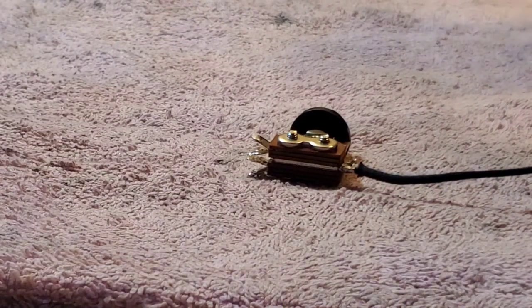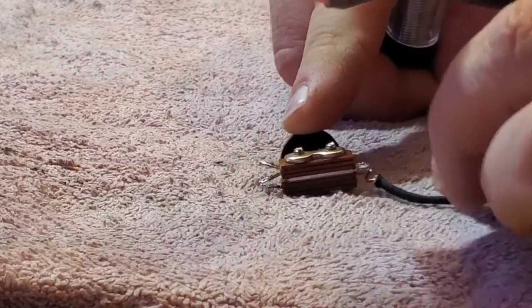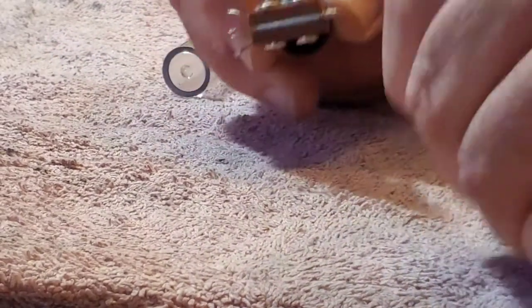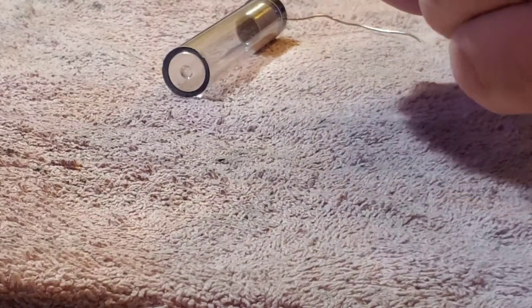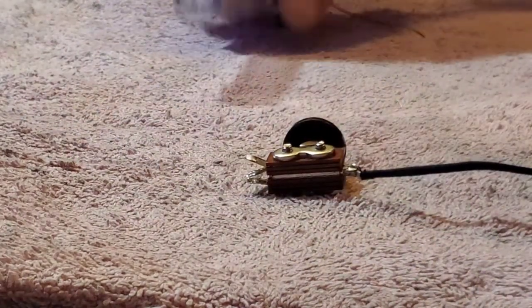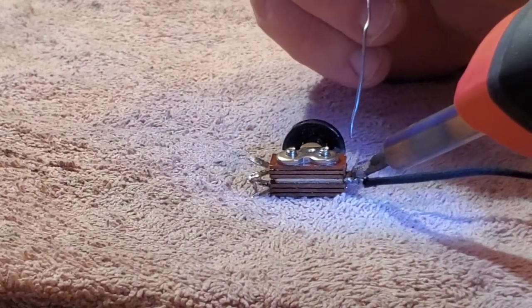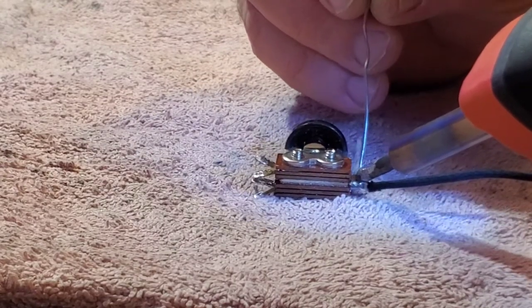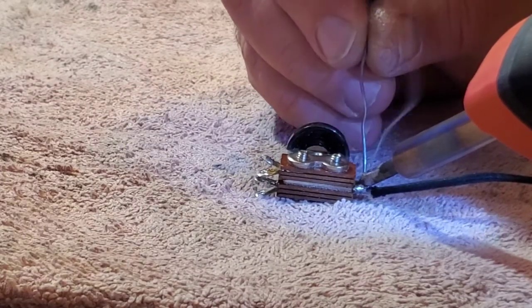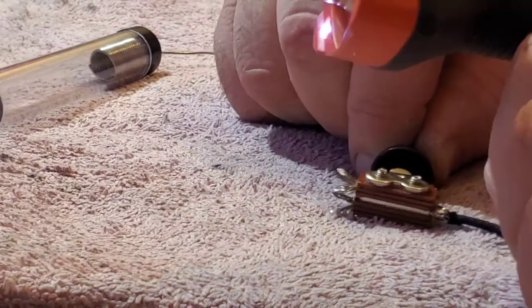So, yeah, this wire is nice because it's already pre-tinned and it's got the cloth covering on it, push-back cloth. Put that in. Now this switch is used. This one, I had cleaned off all the old solder off of it. I'm pretty sure it works. I just took it out of something for some reason. So we heat this up. Nice shiny connection. Alright.